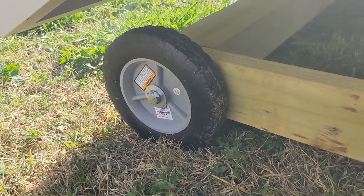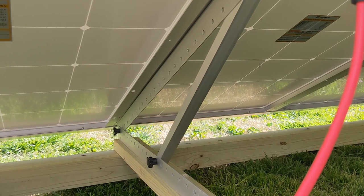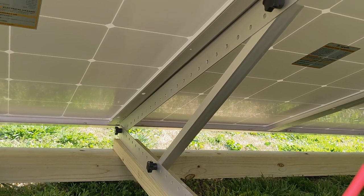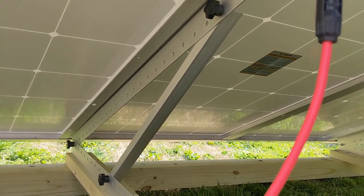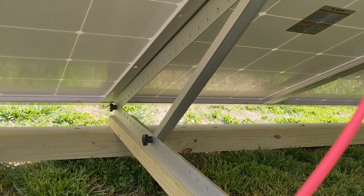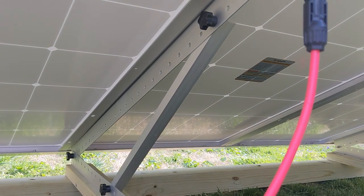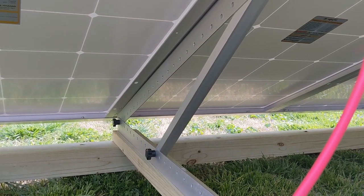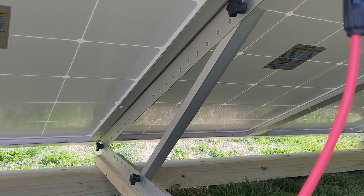I didn't put the extra supports on like Jasonoid did — I don't feel like it's needed, but if it ever starts getting loose I'll add them. The solar panel mount is one that you can easily adjust. It comes in a pair and it's meant for just one panel, but I've got all four panels mounted using the aluminum angles. The array is pretty heavy so I put a two-by-four underneath each side to help support it while adjusting. These mounts are surprisingly very sturdy. To determine the optimal angle, I'll put a link below to a website where you enter your zip code and it gives you the best angle by month and season. There's also a mobile app — you lay your phone on the solar panel and it shows you the angle, which is really nice.